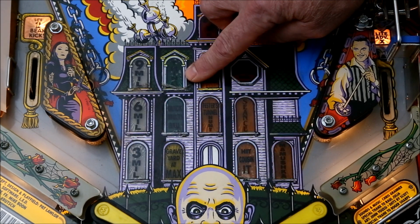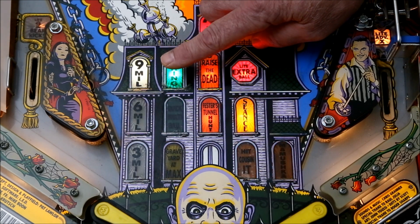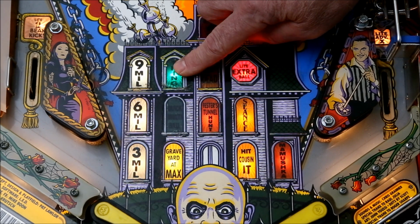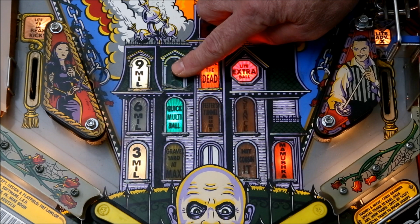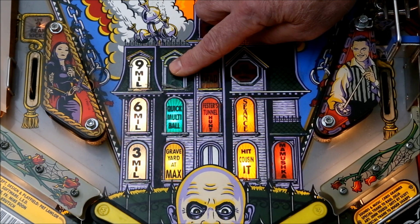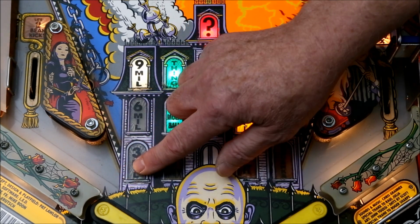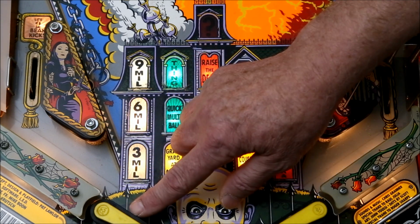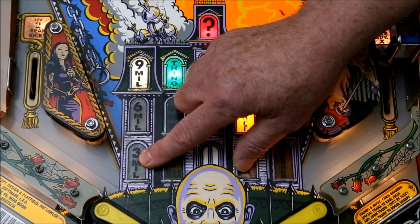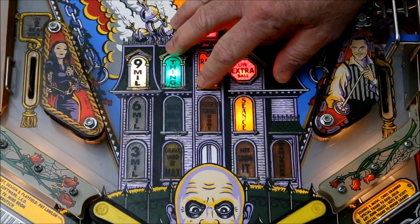I wish everything I had learned about LEDs was good, but there are a couple of downsides. Because LEDs react to fluctuations in voltage much more than incandescents, the subtle flicker in the lights caused by the AC current being fed to them is more pronounced than with the original lamps. Second, if you use playfield details to help aim shots, and there's a lamp near the flipper, the brighter LEDs may create enough glare to interfere with aiming. Still, viewed overall, I think the pros far outweigh the cons.